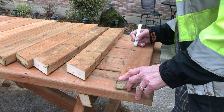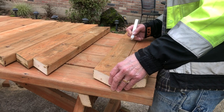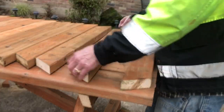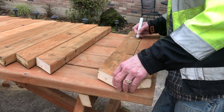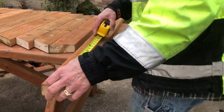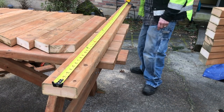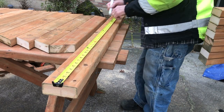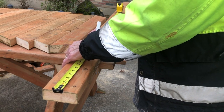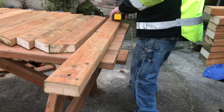I'm making five of these tables, that's why there are so many battens here on top. These are the tabletop battens that go underneath the tabletop — each one gets two screws coming up from the bottom, so there are five marks and a screw on either side. These are the seat braces and they get five pocket hole screws, plus two screws on the end going through a brace that comes across the end of the table.